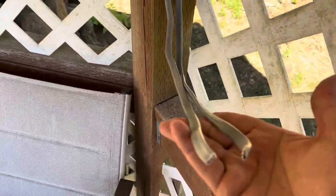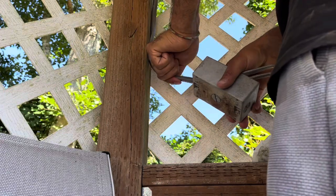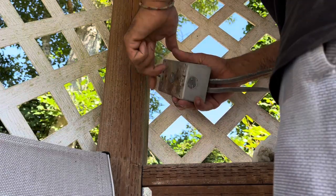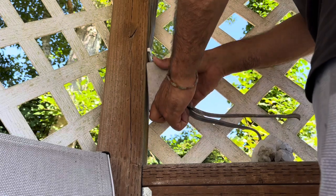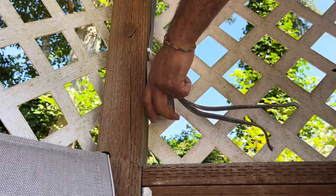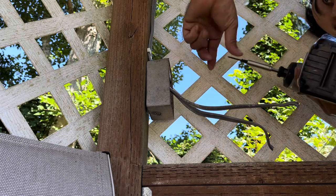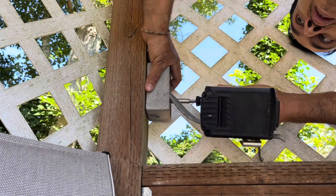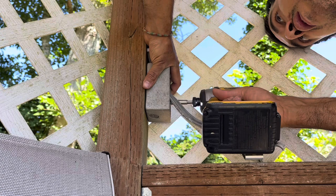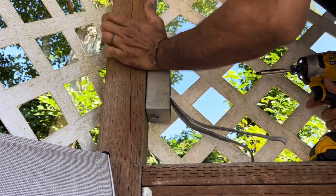The wire is hanging right there on a four by four pressure-treated post, and I'm going to be screwing through the box and into the four by four. Once I get it nice and snug, I'll push it against the four by four and drill right through the box, connecting it. Once I have the amount of wire that I need, I'll be able to hook up my outlet and continue the process of connecting my first outlet.